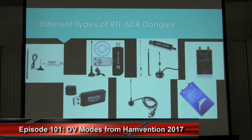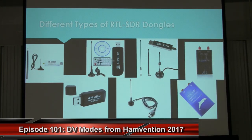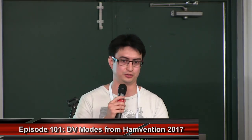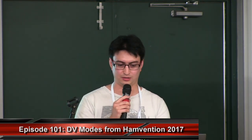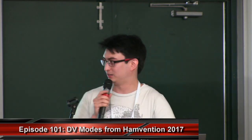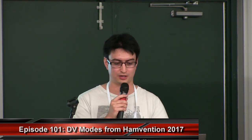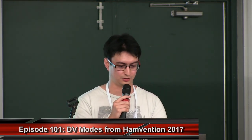If you go on eBay, AliExpress, or Amazon and type in RTL-SDR, you'll probably see dozens of different types of units. The basic dongles tend to come with a CD that has pirated DVB-T software and usually go for about $8 to $10 US, but as I explained, they have some problems. There are also very small dongles about one centimeter by one centimeter, great for mobile phones. There's also the E4000 chip, which is more expensive because the manufacturer went out of business. The most commonly used tuner chips now are the R820T2s, which are actually better than those older tuning chips.